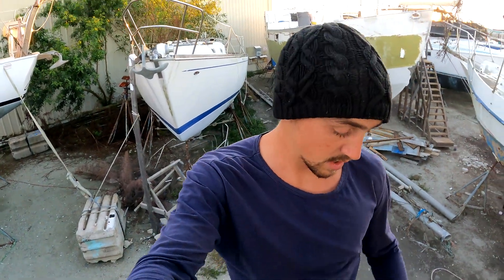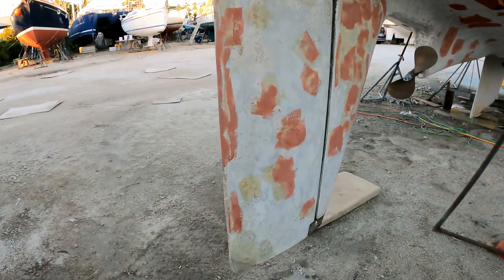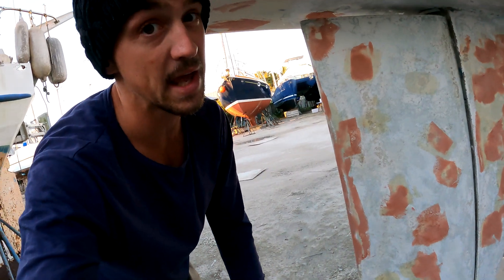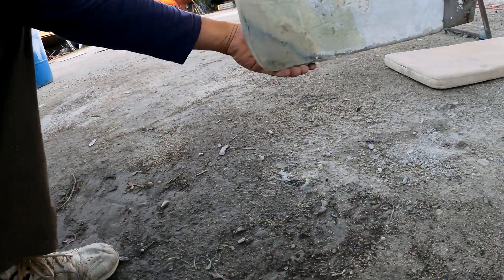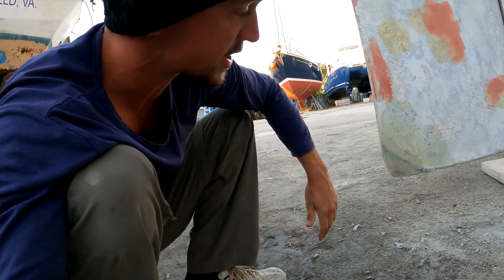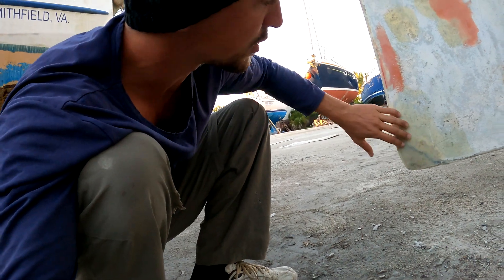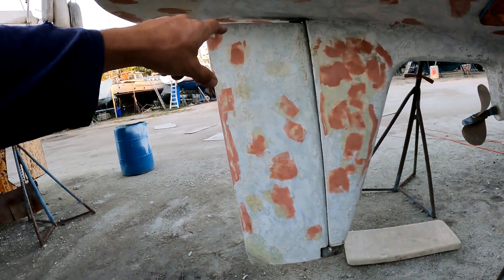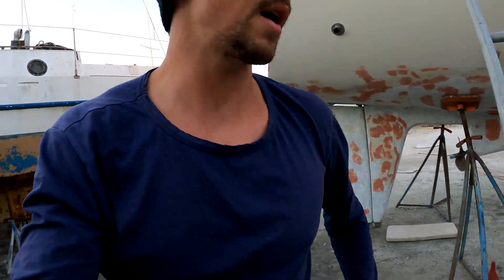I have not painted the boat yet — I plan to do the decks first, then the topside, then the hull, and so on. Taking a look at the keel, the rudder — I'm really happy with the glasswork I did. It looks great, it'll be very functional, and it's stronger than before. I removed the damaged material, put new glass down, epoxied it, did a final coat, and just finished scuffing it so paint will adhere. The corners are nicely rounded — very happy with how it turned out.